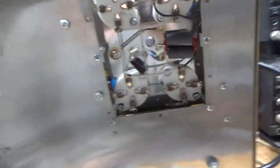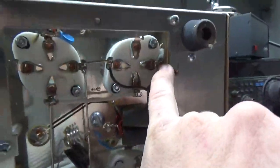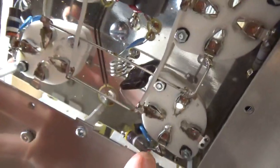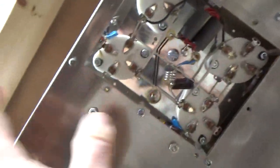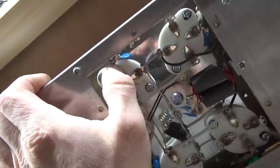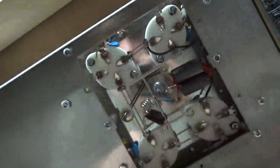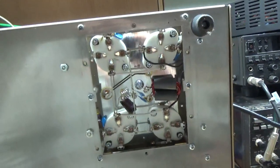Hey, I'm back real quick. Someone's changed the resistors before — you can see one here, grid loading, one there, one there, and one here. These two are different values right here and here, and that's a different type right there — a different value than one of those. So I'm going to pull those out, pull the cap out, and go directly to the chassis.